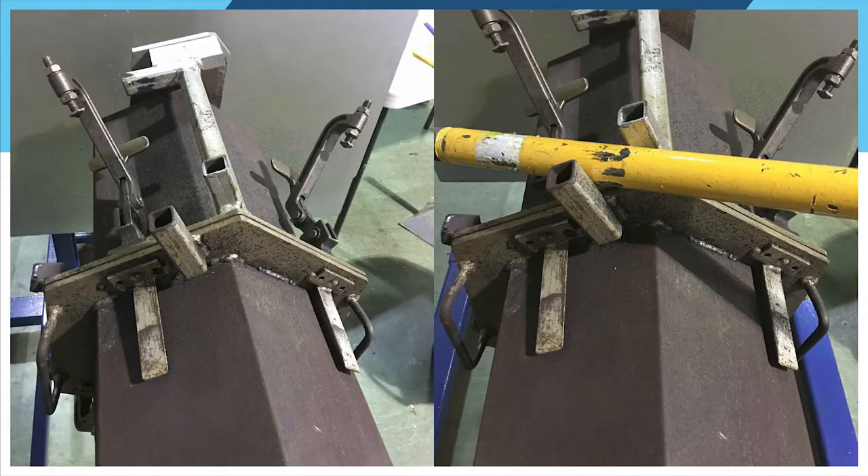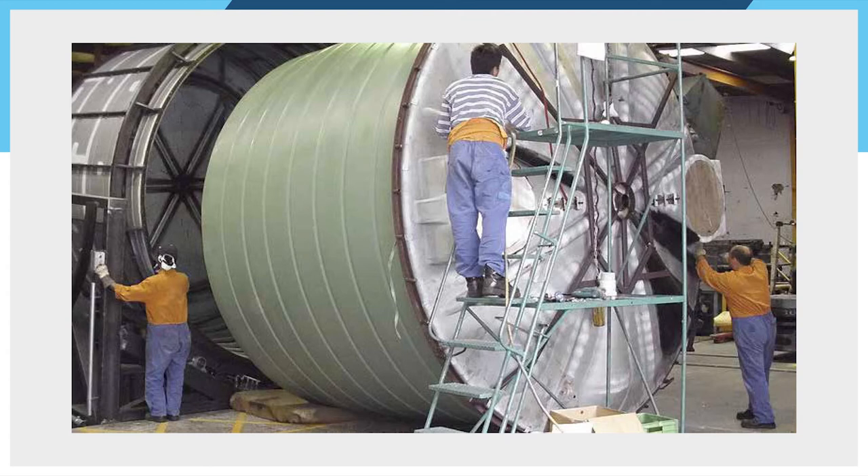So, what can you do? First of all, don't panic — most stick-ups can eventually be released. If there are pry points provided, use them. If you don't have a pry point, can you improvise one, perhaps using the adjacent framing? On large moulds where stick-ups can be a real disaster, can you use the crane or even a bottle jack to apply pressure remotely to the parting line? Sometimes, if you leave the mould to cool down some more, there will be enough release of the part inside to get the mould halves separated. If you're running out of time, get the mould off the arm of the machine so you can let it cool down fully and work on it offline when you're not in a panic.